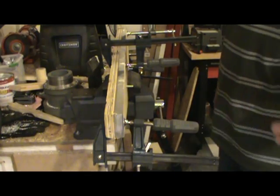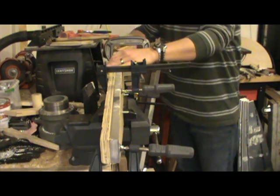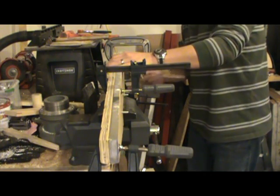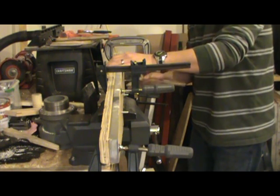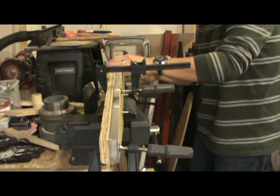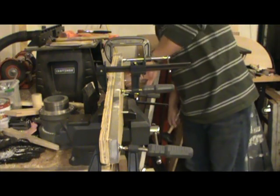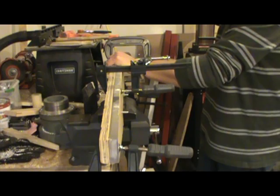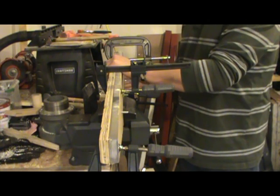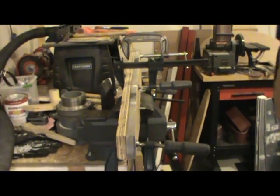As you can see, when there's no flutes in there you can actually form that relatively quickly. Same goes for the other end. You work your way up and down the flange until you've got it flat against your forming board, and when you're all done it's nice and flat with no crimping locations on a perfectly flat 90-degree bend with no curvature.